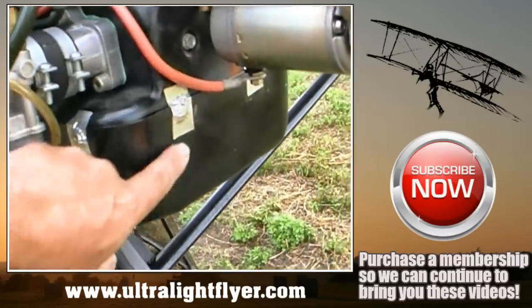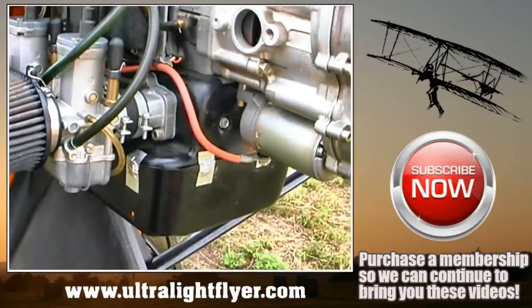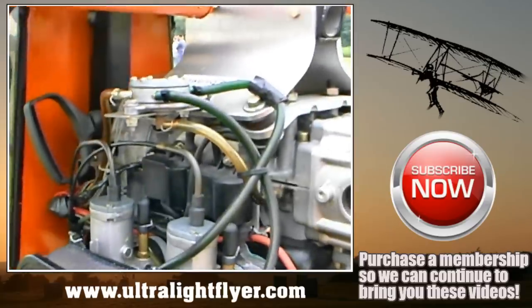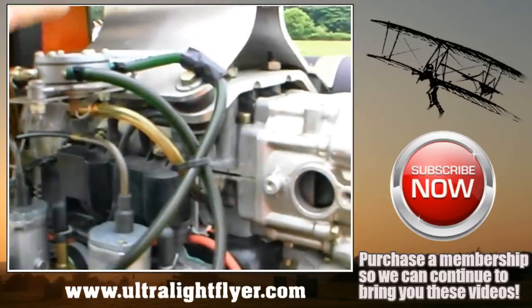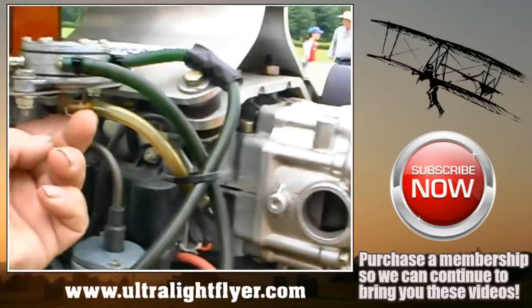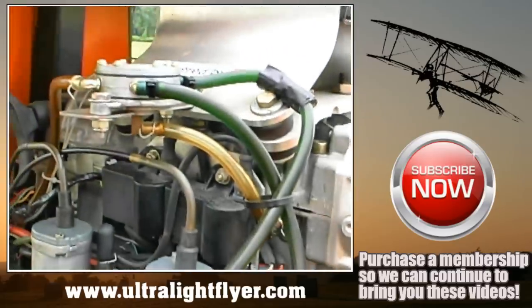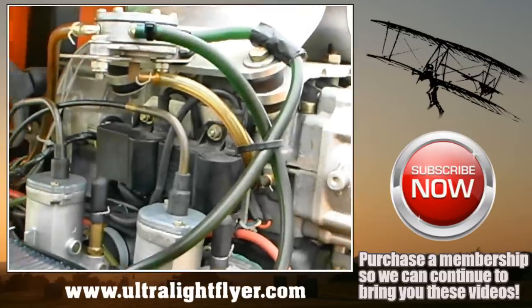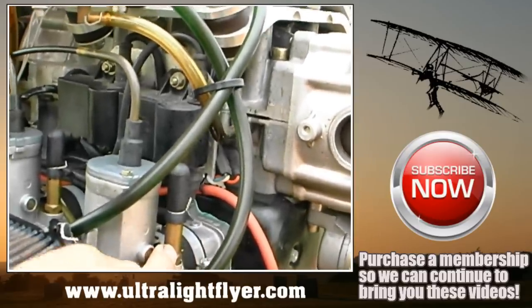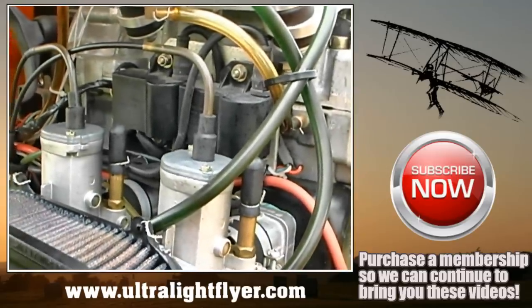You can see this individual has put duct tape to prevent the bolts from entering the exhaust system. This is the proper installation for the fuel pump — the fuel pump is mounted above the impulse line, with the impulse hole facing down. This line is a thick-walled line and the whole system is clamped. The pilot has also put a rubber socket over an unused choke to prevent water from entering.